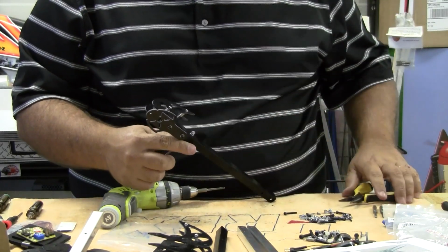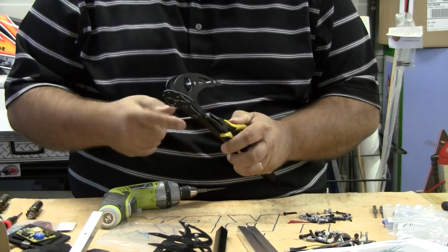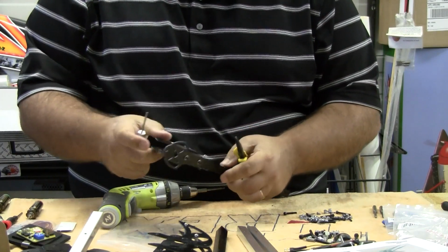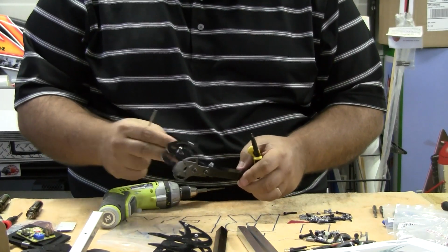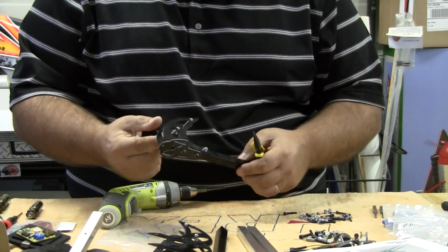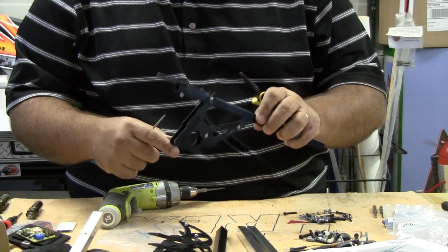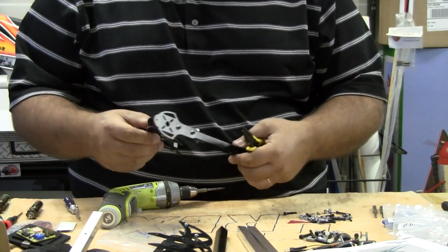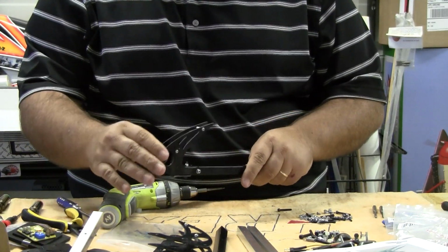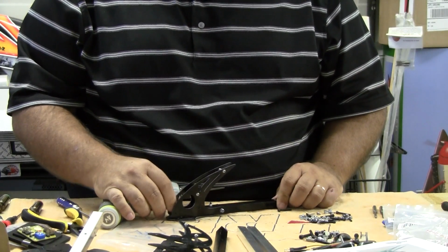This is a 2.5 millimeter. I don't think I said that a while ago. I want to do this by hand again because I want to be able to feel how tight that's getting. You're going to get it tight, but you want this to move because, again, I was talking about that spring, so that should move pretty freely and pretty close to itself if you shake it. That should be tight enough. So we'll put all 4 of these on, and then we will mount the springs to all of them.